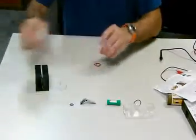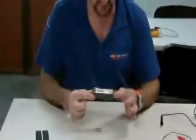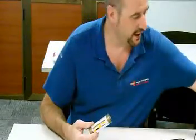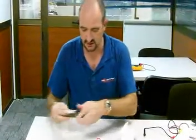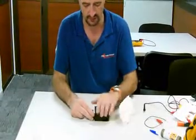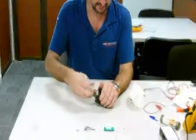Okay. So, first thing, take the beacon from the vessel, which needs to have the battery replaced, and clean it on the outside thoroughly with a light detergent. Once you've done that, place the beacon inside the housing of the clamp, put this in a vise, put the cap on the end, and turn.